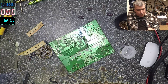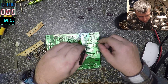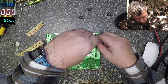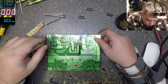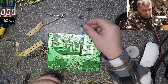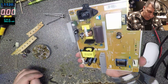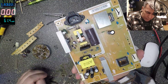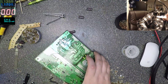That's great. Now let's check one more time — exactly that the plus and minus are all correct. Everything looks fine. It's not like you must use 820 microfarad exactly — you can use something bigger, that's better, but even if you have less it's fine. I used 470, 470, 1000, 1000 here. Everything is fine. Let's test now and see if it's working.